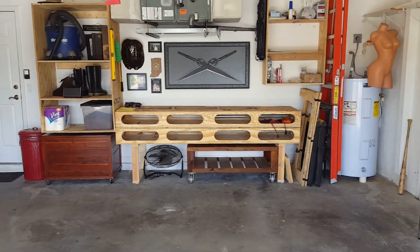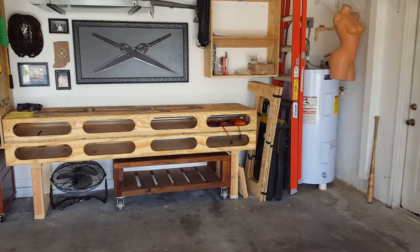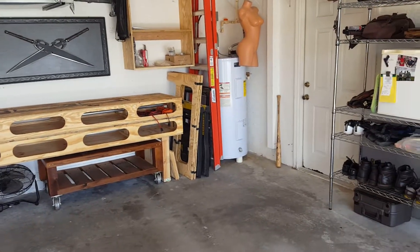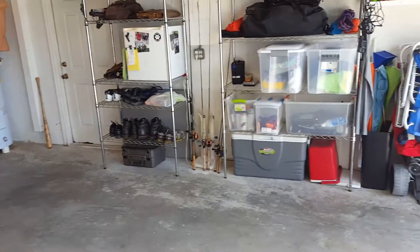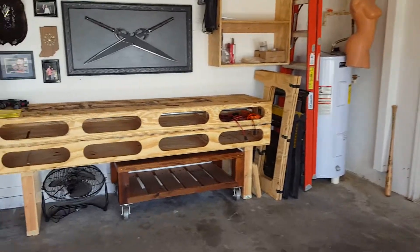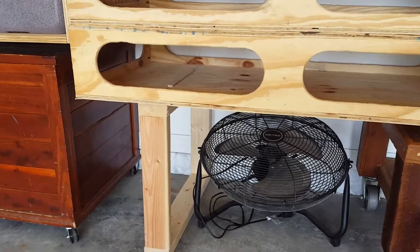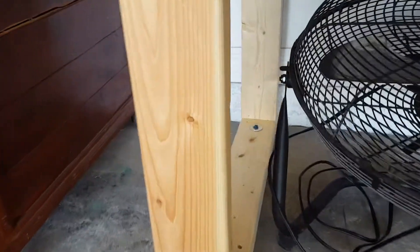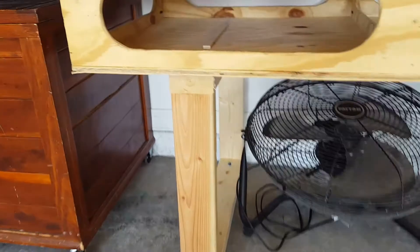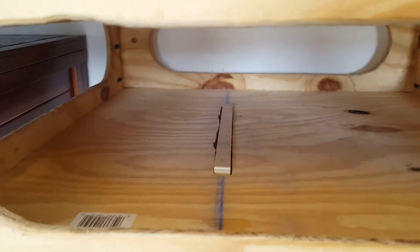I had to get all my tools out of the trailer and just wanted a workbench. I wanted to use Ron's design, but I can't have it set up four by eight fully all the time because my fiancée needs to park her car in here. So what I did was just build a little two by four box bracket type thing, anchored it down to the floor using a couple tap cons and some good fender washers. I had to shim it up since these garages are sloped a little bit.